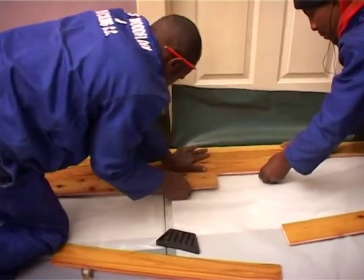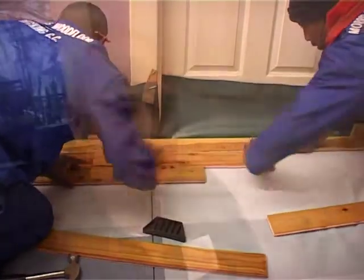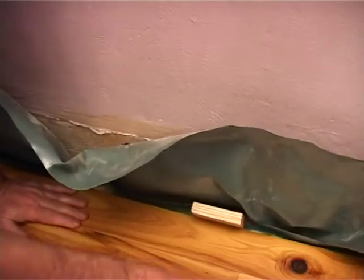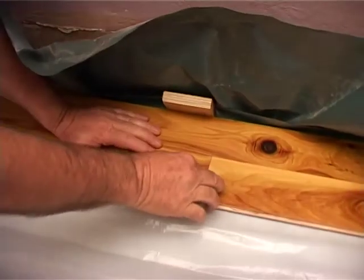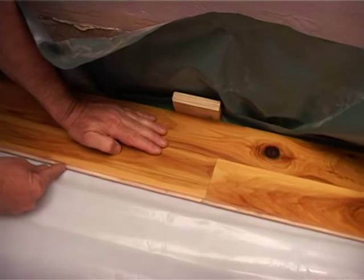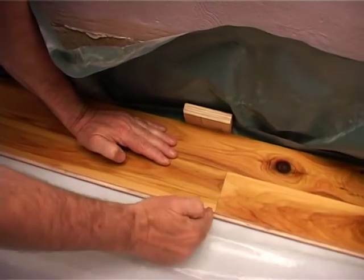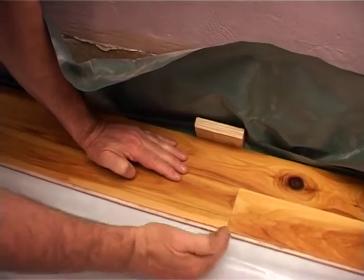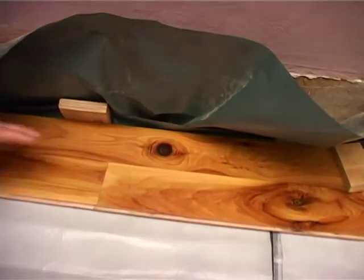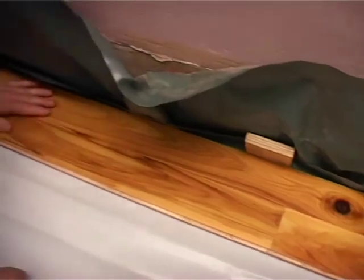With the strip flooring, you normally get staggered pieces. This helps to create an uneven stagger in your floor. And when you get to your joins, as you can see over here, you don't want any other piece to be too close. You want at least 200 millimeters apart, so that will give you the strength. If you put it too close, you'll get a bit of weakness. So 200 millimeters apart at the minimum, and fully staggered, no patterns to be created.